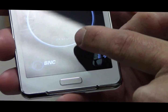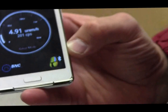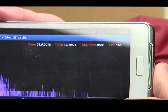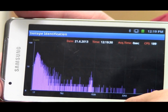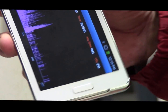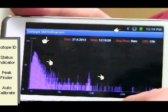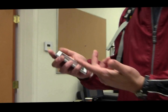Let me exit out of the setup mode and go back to the ID and dose rate counting mode. If we want to take a quick glance at the background, we rotate the screen sideways and here we are collecting background — a very nice quick presentation to make sure the detector is working well. That's a typical background continuum here at Berkeley Nucleonics offices. You can also see the K40 peak starting to develop, which is part of our stabilization routine. If I want to reset my count and start over, no problem. Let's put this in my pocket and take a little walk to monitor the warehouse.